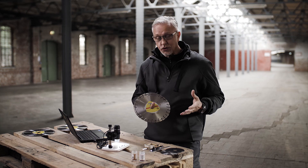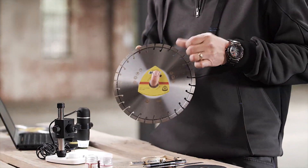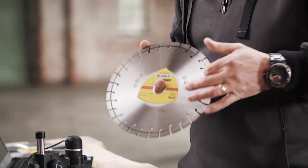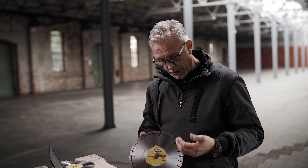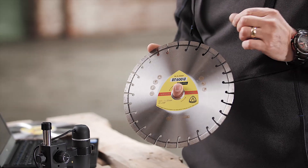To summarise, we've looked at three important components of a diamond wheel. First is the diamond itself and the quality of the pure yellow diamonds used within the segments. Second, we've looked at the core and the importance of its thickness for heavy duty work and longevity of the diamond product — this is an essential component. Third, we've looked at the fastening mechanism: the sintered bonded method is OK for light duties, but in a professional environment requiring long lifetime and high feed speeds, the laser welded segment is by far the most secure method of attaching the diamond segment to the steel core.